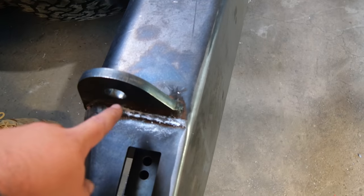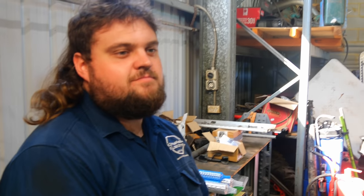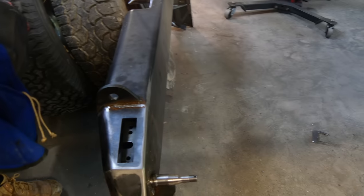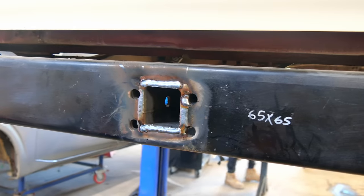the Kinsela bars, these built-in recovery points aren't just for looks, they're actually the plates that bolt it to the chassis. So you're going to have 3 or 4 high tensile bolts holding the rear bar on and then also to recover off. So should be plenty. Very exciting. Looks good, mate. And then you've got your little pin which is sneakily in behind there. So you'll be able to just reach in and go, boo.